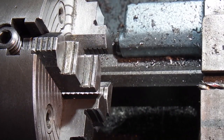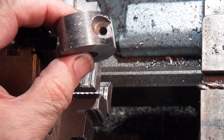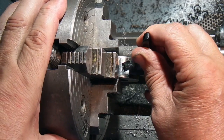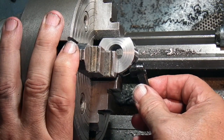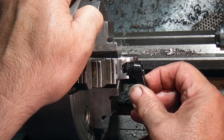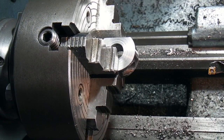I would say it's quicker to do it on the lathe for facing off that part, and even this part's quicker than trying to use a milling cutter in the chuck. After all that, I've found a problem — this won't fit down into that hole. Probably doesn't need to really, but for the sake of a few more thou on that, it would then fit neat. So I'll go back to the boring bar.